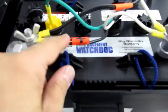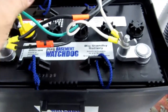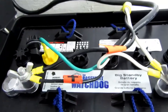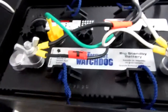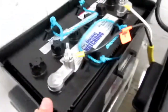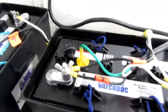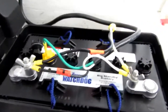I've got two wires coming off each side — they use wing nuts, so no special tools required. This yellow cable is another thing I had to order from Glentronics — none of the stores I found that carried this product had the battery boxes or this yellow cable. It's nothing special; you could buy a cable from the hardware store, but it's not too expensive so I got the official one. That goes to the second battery — same model, same battery box. It just has both batteries in parallel, and that approximately doubles the run time the pump will go on battery power.